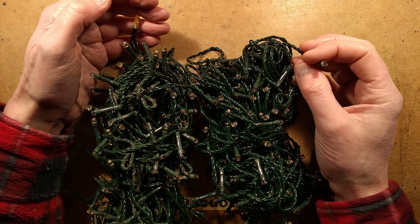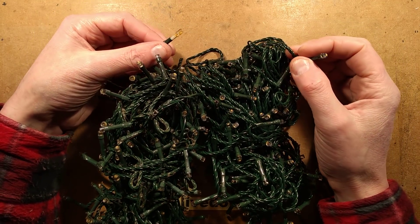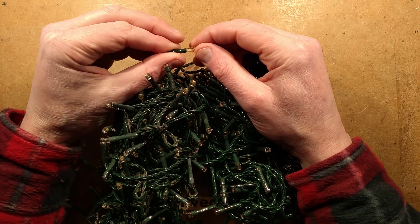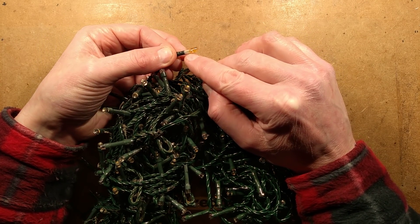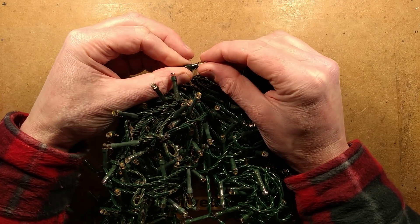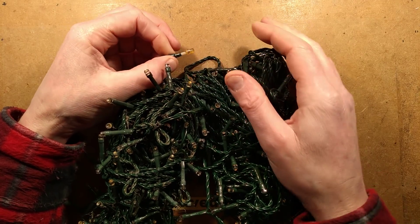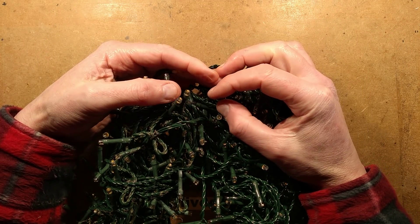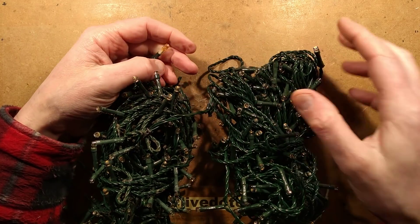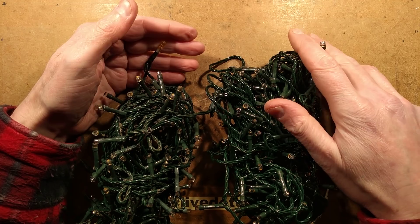Because it's not just static DC across the LEDs, I reckoned that might reduce corrosion. After one year of being out, this is the most corroded-looking LED and it's still not too bad — just a little touch of corrosion at the base. Compared to that, standard strings run from DC — whether multiple wires to make them flash or a single circuit with just two wires along the whole string — those are a different story.